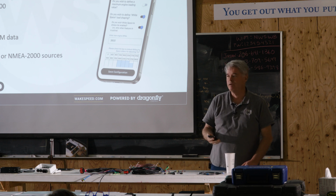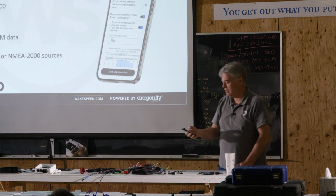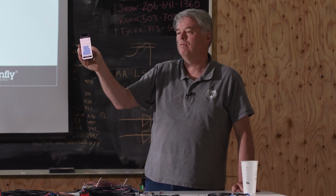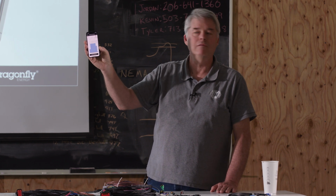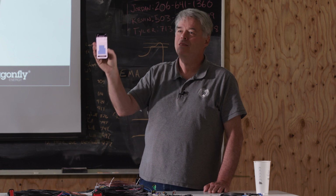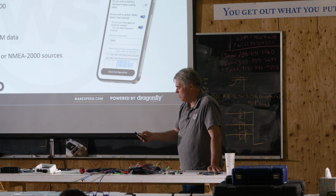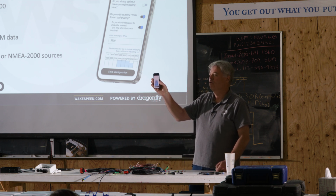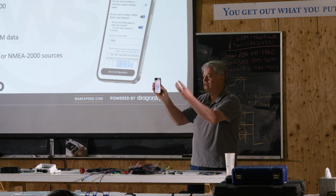Now, let's take an example of somewhere in between. We've got a boat with a modest engine that struggles a little bit at the low end, so maybe we'll limit it at the low end to 40%. At the high end we've got the same condition because the output and the alternator loading match, so we'll leave the high end the same. But this guy's struggling to get on step, and we've figured out that this boat tries to get on step right around 1200 RPMs. So I'm going to take the slider at 1200 RPMs and pull it back. That reduces the alternator load on that engine while we're trying to get the boat up on step. There's three examples for you.